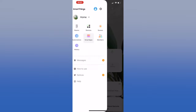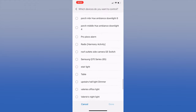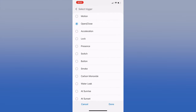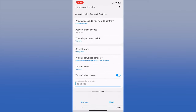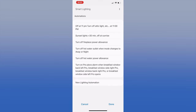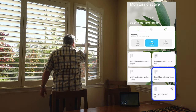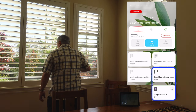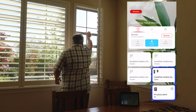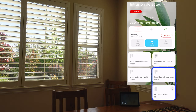Using Smart Lighting in Smart Apps, you can create a routine to take action when a window opens. Select New Lighting Automation, select your piezo alarm as the device to control, and set the action to Turn On. Select Open/Close as the trigger and select any of the zones you want to monitor, then select Turn On When Opened. For when to turn it off, we selected one minute, then saved it. Let's try this out. First, we arm the SmartThings security monitor. Notice the SmartThings app shows all four breakfast room windows closed. Open a window — the buzzer sounds, SmartThings shows open, Alexa notifies, and the security monitor shows an intrusion. When we close the window, SmartThings shows the window closed, though the intrusion alert won't go away until you dismiss it. You now have your zones reporting to the SmartThings app and Alexa.